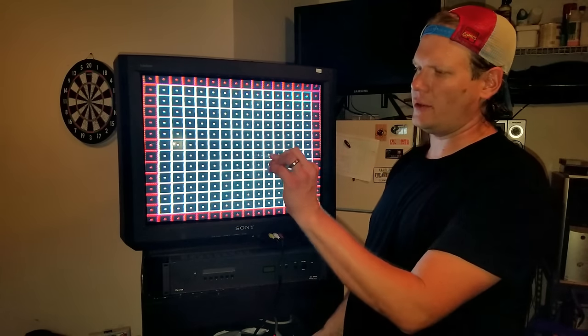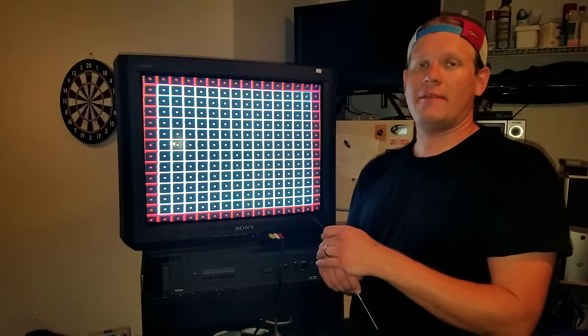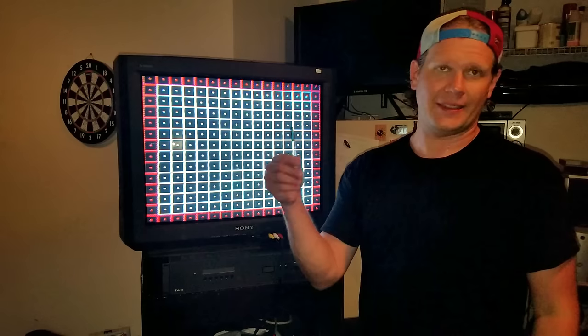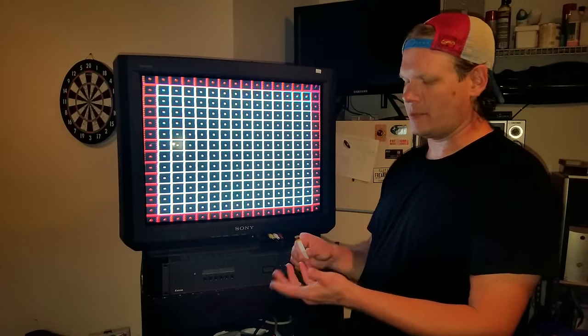It's just a magnet on a piece of plastic with some nice two-sided tape. This is the original one, but let's say you don't have enough in your TV and you still have some color convergence issues. You can either try to take these old ones out and move them around, or sometimes the magnets can go bad and it might be time to replace them.